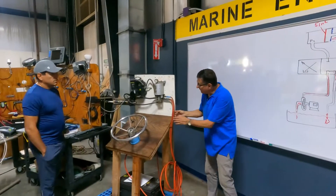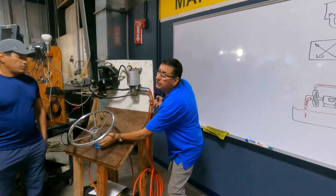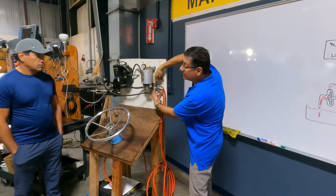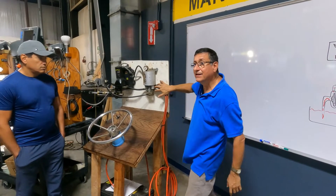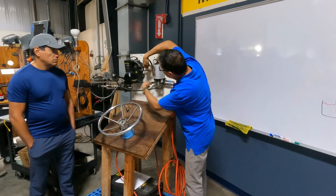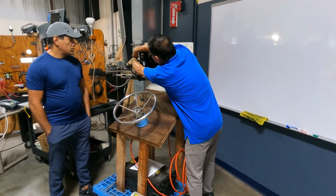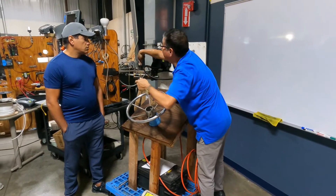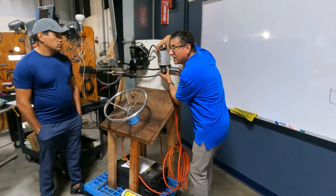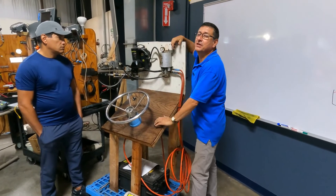The reservoir — port and starboard lines coming from the pump. I cut those lines, I enter here, and on the other side I continue into the power assisted unit, and on the other side of the power assisted unit I enter the cylinder. In other words, I install in series the reservoir and I install in series the power assisted unit.